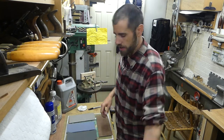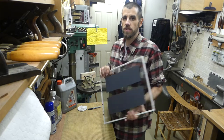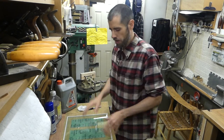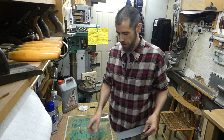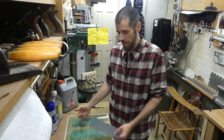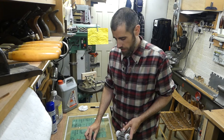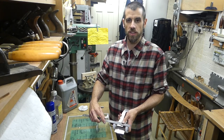So I'm going to stick with the float glass theme but use a bigger piece. I've already made a start by sticking the 240 grit and 500 grit onto one side. To keep the video to a reasonable length I've pre-cut these pieces — on the back I've used the full length of the sheet at 280mm, and I've cut the width to 110mm, which gives me the full width of the blade plus the guide plus a little bit of movement either side of the honing guide.